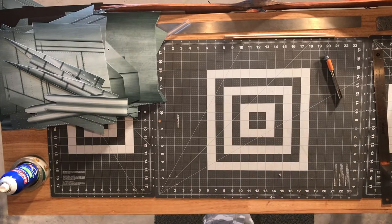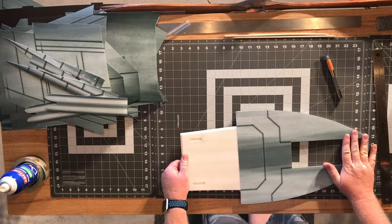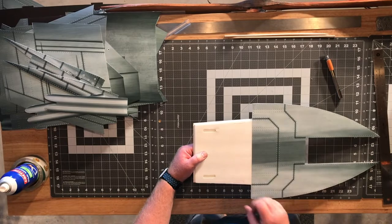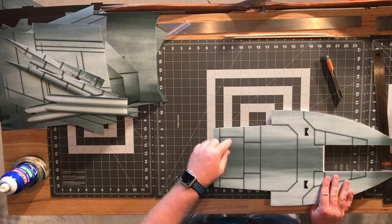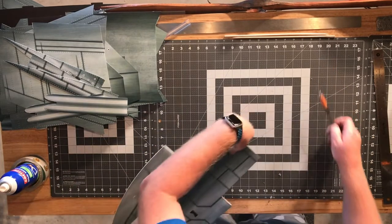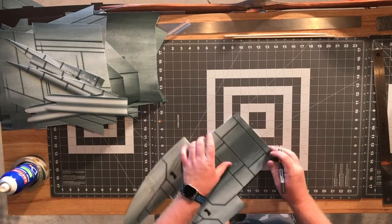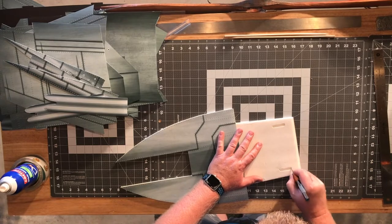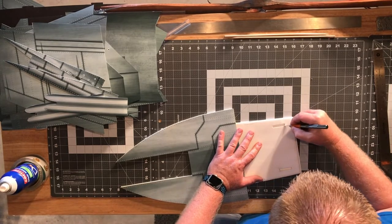All right. Had a little technical difficulty there, but what we did was we skinned this side. Remember, the half piece goes on the side with the score cuts, and the full piece goes on the side without the score cuts. Last thing we've got to do is cut these in. You can actually do it from the back side, through the skin on both.